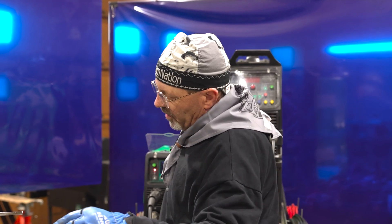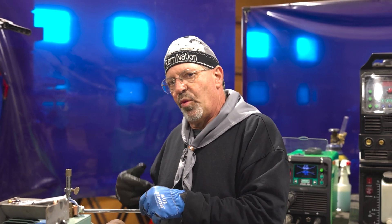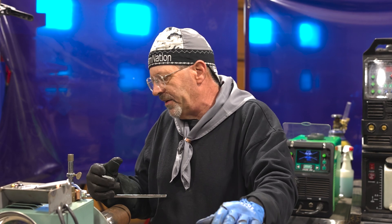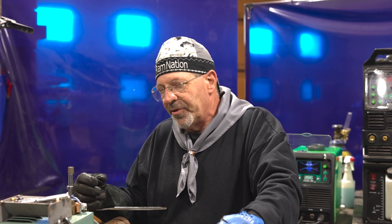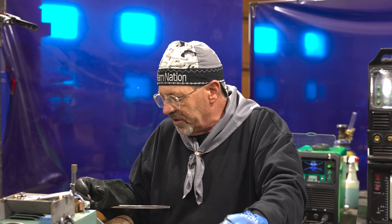It's essentially welding at about 10 to 11 o'clock over here — the pipe's rolling away from me. Technically it's in and around the flat position, downhill route, whatever. I'm going to change values after the root. I'm attempting to get 100% root fusion on the first pass, but I'm going to create a problem here.